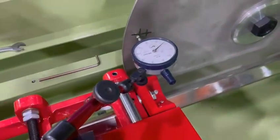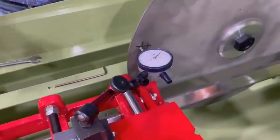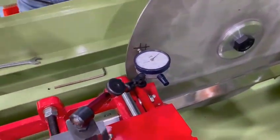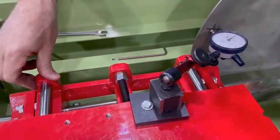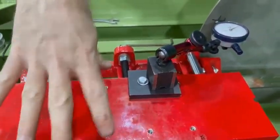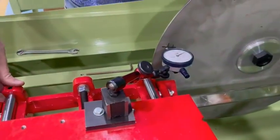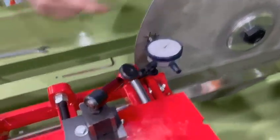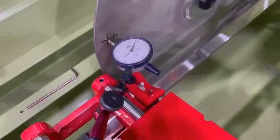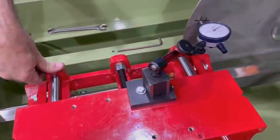If your carriage is moving all around, you really have to be careful not to touch it. When I move the carriage, you'll see my hand is down here. I don't touch the cross feed, because if I move that even a little bit, it can throw off my measurement. So I set zero — I'm not perfectly on zero, but I'm close, and for the first pass that's fine. Then I'm going to move the carriage from here.